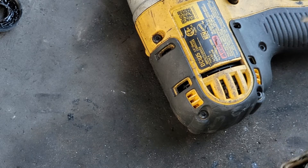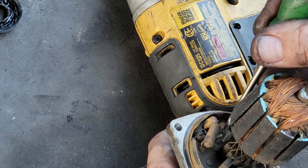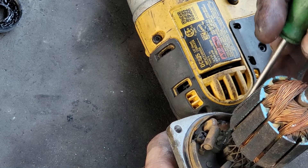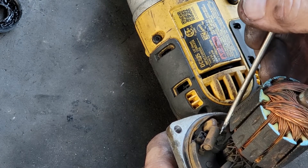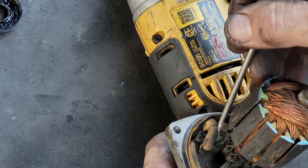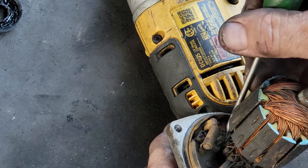I'm trying to figure out what the problem is. We have water intrusion, yes, but the actual problem is — you can see right here where I'm pushing that brush back — in the guide that guides the brush there's a slot in the top, and the spring is pushing the brush up against the armature. This wire that connects the brush to the circuit is going up against the end of the slot. The reason the motor isn't working well is because the brushes are worn out and they've gone all the way to the end — that's as far as they can go.